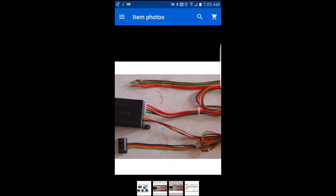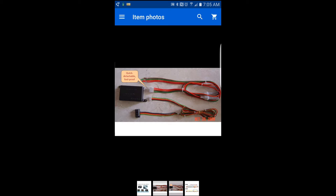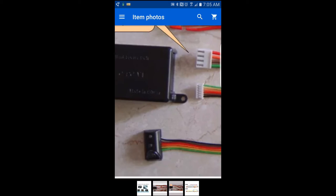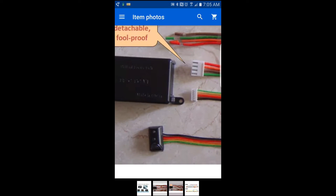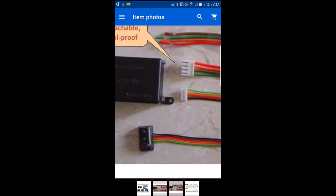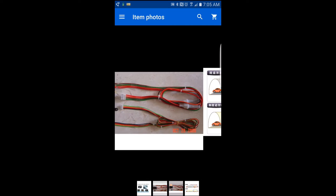The upper portion has just four wires, and that's actually not that difficult to wire up. This shows them detached. The only issue that we had is that the lower one — see the little white plug? — the female portion of the socket was not pulled all the way down. So although it looked like it was plugged in, none of the metal leads were actually connecting into the wires. So the system would just turn the lights on all the time — there was no automatic sensing. Once I seated those things down on the motherboard, everything looked great. I'm very happy with it so far.